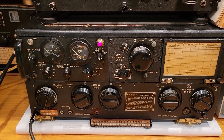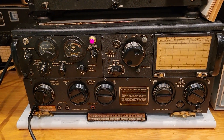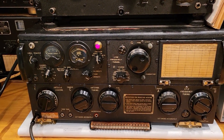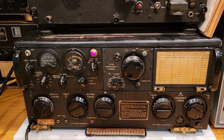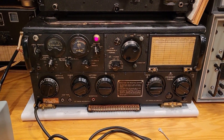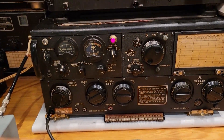So I guess that concludes this until the next thing. I think the next thing I'm going to do is take the receiver off the transmitter — I was a little optimistic there — take the transmitter out, open it up, and very carefully look to see what relays may be involved, or maybe bias resistors or something that's off kilter.